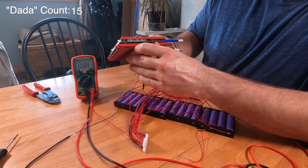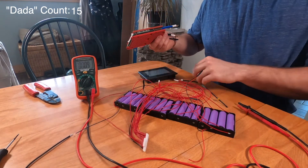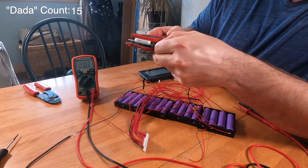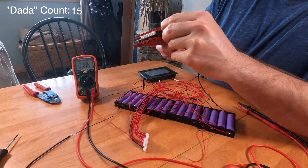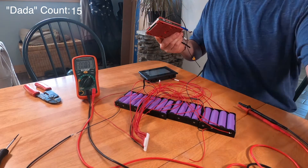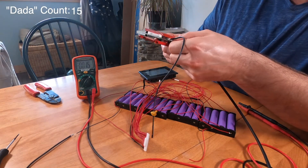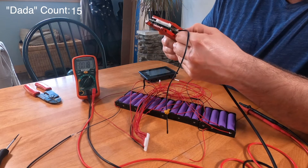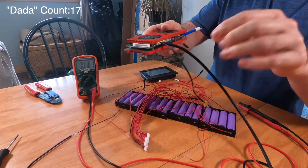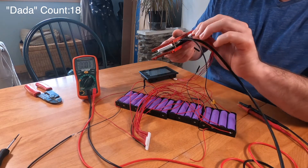The BMS has an NTC port which is for the temperature sensor — you plug that in like this. The light board for the battery gauge has the biggest conductor connector on the board — eight conductors on that one. Then your touchscreen connects to the UART port.